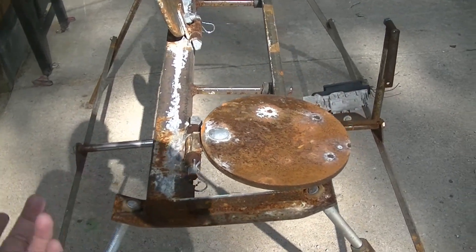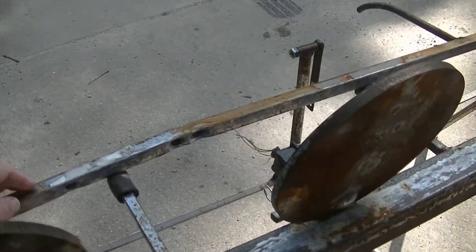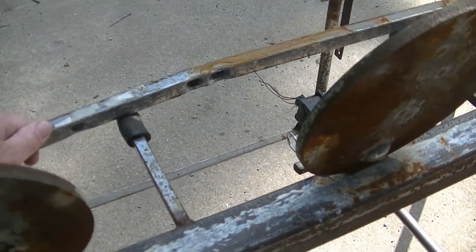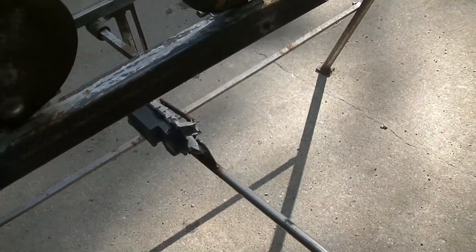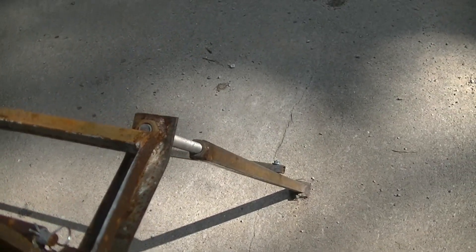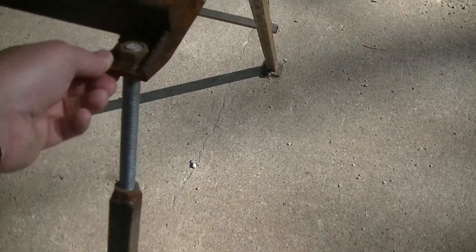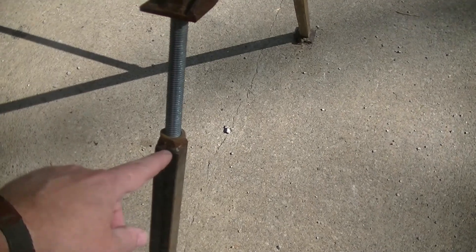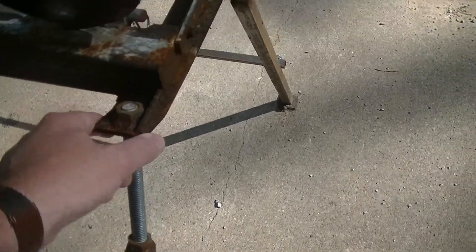What happens is the plates fall over, and I don't have a reset on it right now. I do have the reset bar, and I am going to replace it — you can see it took a couple of rounds. A few things I'm doing include replacing that. I'm going to a family reunion in probably a week's time and I want to take this with me, so I'm going to add a bar here with a rope so you'll be able to pull it and reset it. I also don't need all this adjustability on the legs — it actually makes it really wobbly — so I'm going to cut this right here, take the all-thread out, and weld another piece of one-inch in there. Weld it up rigid. I'm going to do that all the way around.